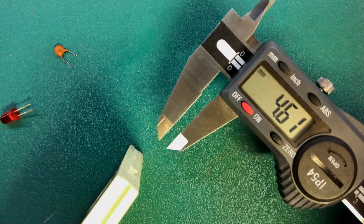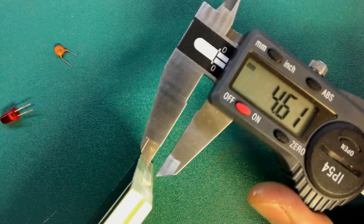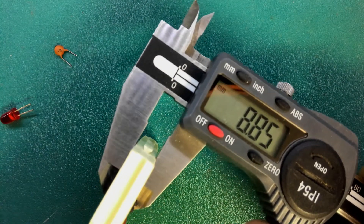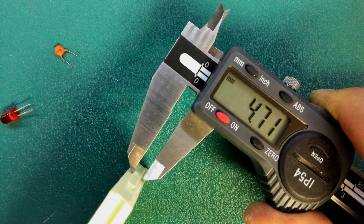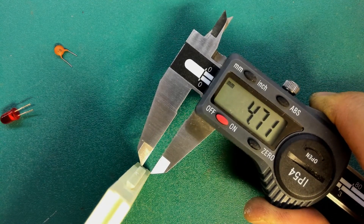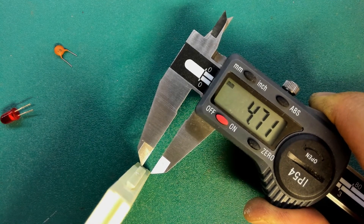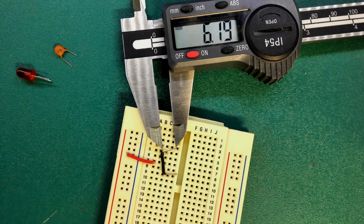Let's start by looking at how thick our breadboard is. Most breadboard is about 10mm thick, and if we measure that, you can see that this is about 9mm. If we just assume that the little clip in there is about 5mm thick, you can imagine that the wire will have to sink down that far. So at about 5mm, that's going to hold quite well. And if we have a look at the length of the exposed wire on that jumper wire, we can see that it's about 5mm.